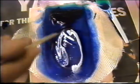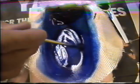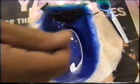Now, two things happen with epoxy, especially West Systems. When polyester starts to kick, you get a little bit of a warning, and all of a sudden it's cheese, and then it's cheese for about 10 minutes, and you can still maneuver it around and move it. Epoxy tends to kick differently. It kicks, and then all of a sudden it's a solid, and you can't do anything with it.